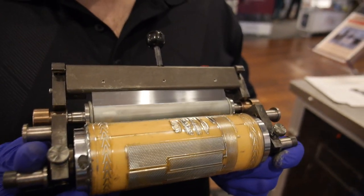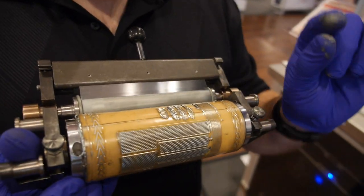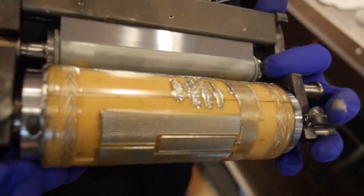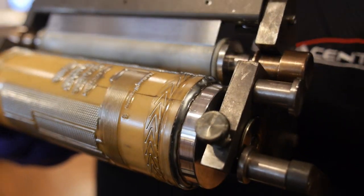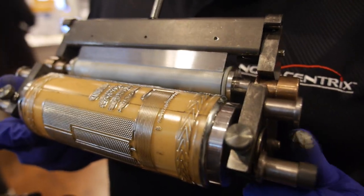So you're putting exactly the right amount of ink? Exactly. The anilox has little cones cut into it, and if the cones are deeper then you put more ink. This one has very small cones, so it only puts just a little bit of ink down. It makes a very thin film, and that thin film means we're very efficient with the ink — we don't use very much.